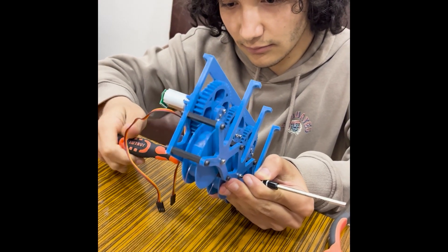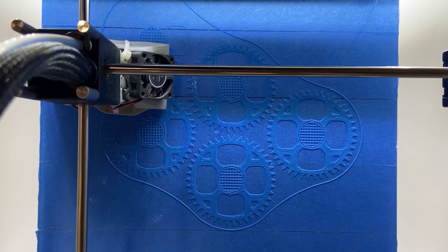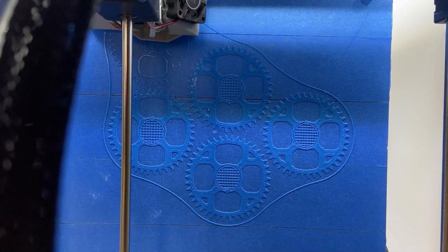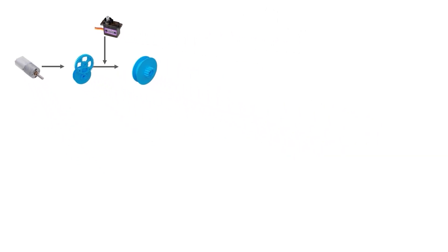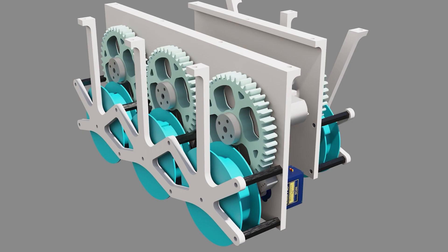The payload mechanism consists of five identical systems. Due to reliability and controllability factors, a system involving a DC motor with a magnetic encoder is designed. Each system includes a DC motor, gears, a pulley, and a mini servo motor. A 6V DC motor is chosen and a gear system is designed at a 3-to-1 ratio to achieve the desired torque and RPM values. Gears are locked by a mini servo motor until the airdrop starts. The payload is attached to a fishing line wrapped on a 2-inch diameter pulley. The system is then quintupled to drop all payloads in a single flight.